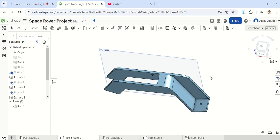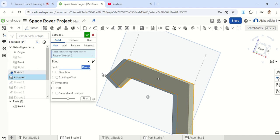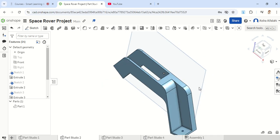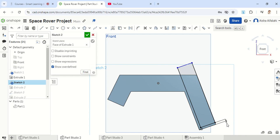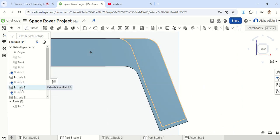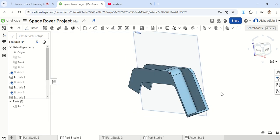Clicking the tick, you'll notice the shape has changed. Another thing to make sure is changing the extrude value — originally we had 25, change that to 31. I've noticed during assembly that the dimensions were not giving enough space for the motor once we try to add it later on. Moving on to sketch 2, there's not much change — just a distance of 3 mm from each edge. Sketch 2 will remain the same. The second extrude will have to change from 22 to 25, so make sure you type in 25.